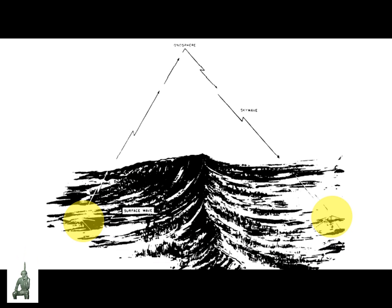Here's from that old Army manual that shows two radio stations using NVIS antennas in Vietnam to get over a mountain line or ridge line. You can see the four legs of the antenna. These two stations are set up with NVIS, using HF radio waves to bounce signals off the ionosphere and come down on the other side of the mountain to communicate with the other station.